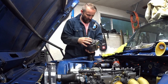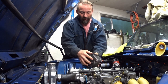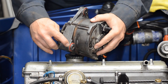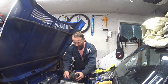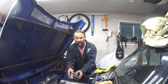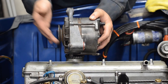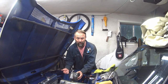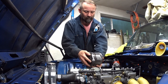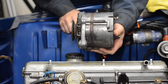Here we are ready for install. In case you're wondering what I did on the upper bushing: I ground it flat on the front of the casing, and on the back I let it protrude by about 2.75mm — so between 2.5 and 3mm is where you want to be. That gets all the pins to come together. If you know going in that you have to grind or sand these, it's an easy install. There are no other bushings on the market as good as these, and stock ones are becoming unavailable. On the back side I ground them flush on both sides — just press them in and flush to your casing and it'll fit.